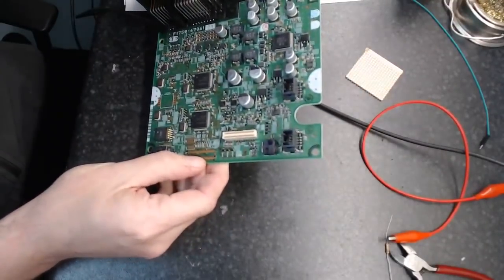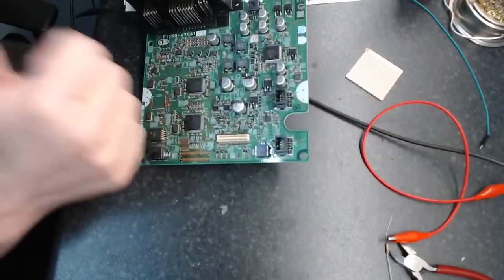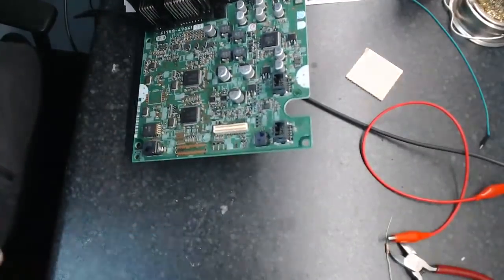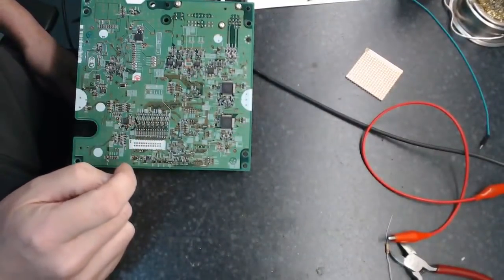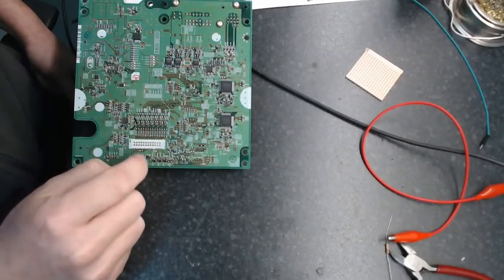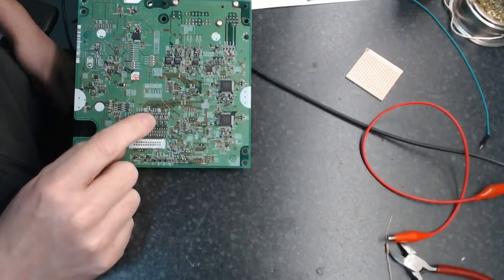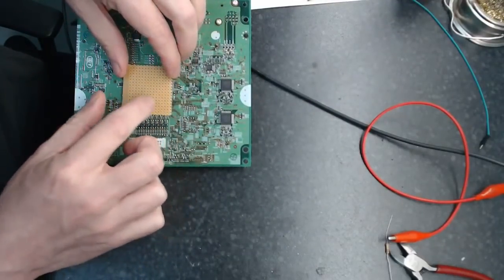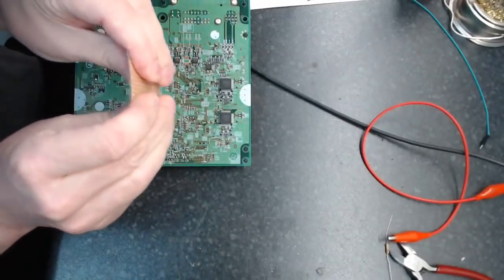Because what we want to do is stuff this, as I was saying, back into the inverter so that we can use it to determine which pin does what exactly. But in order to do that, we need to first sever the link, so we're going to remove all of those resistors and then we can put our own little bit of strip board here. I'm going to wire to that, just use this as a bridge so I can take ordinary wires back off it. In fact, I could probably make that smaller.